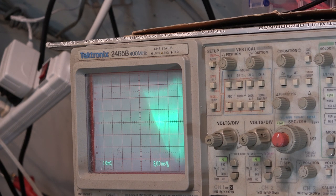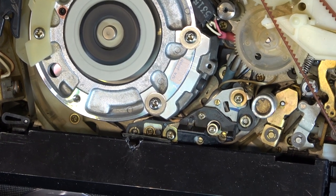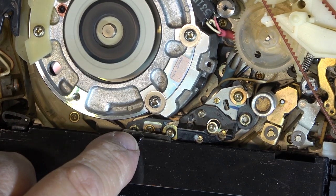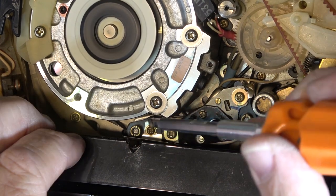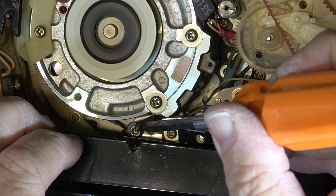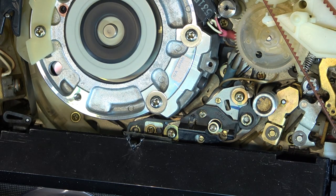We want that waveform completely flat, which we have. I'll show you the adjustment that I made. Any Sony Betatech worth being called a Sony Betatech did this to his alignment tape. It cuts a groove in there so that you can get at it. But that's the guide right there. And I just turned that literally. I just cracked it. I turned it maybe 1 degree